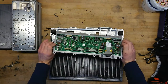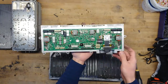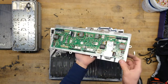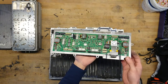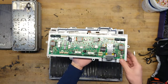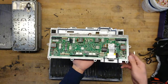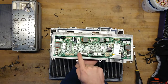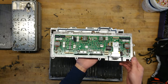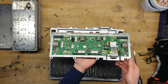It's empty! There it is — the power supply. Nice big input plug, shielded. It actually has electrolytic capacitors — old-school can types. Not every day you see that. The winding of the secondary and primary cores of these planar transformers is also a little bit iffy. Overall: clamped-down SMD MOSFETs and diodes — quite interesting design. A lot of design choices I've never seen before in a base station amplifier.